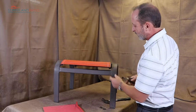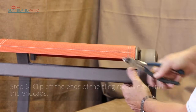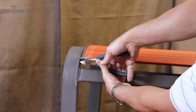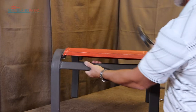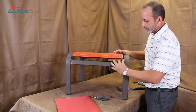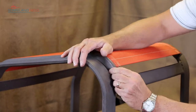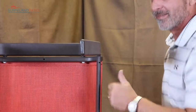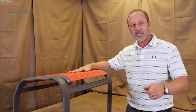Then we'll clip the ends of the sling rods — give them a little pull out and cut them flush. On this side as well, pull out a little bit and cut it off. Give it a little tap with the hammer to make sure it's flush so when you go to put your end cap on it sits nicely. Then put the old caps back in, or if you bought new caps, put them in at this time. Our ottoman is looking good again — hope this video is helpful and we'll catch you next time. Thanks for watching.